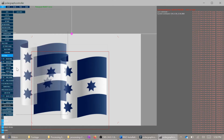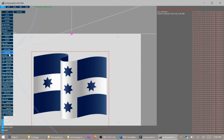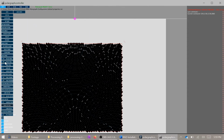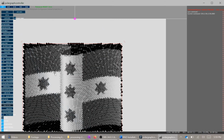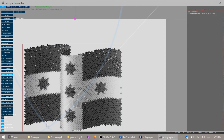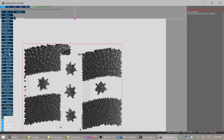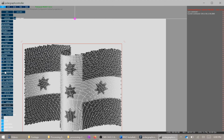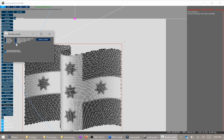The way this works is by printing it with essentially rectangles at an angle, and making them more refined and filled in as the printer goes along for darker colors, and more space between them for lighter colors. Mess with the configuration until you find something you like. When you're done, just hit print. And don't forget to unpause the queue on the right.